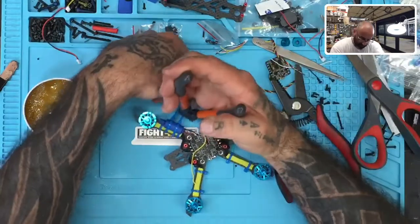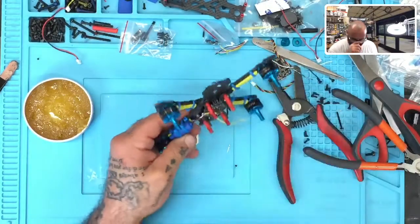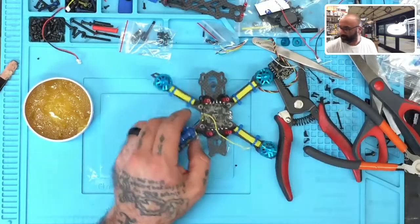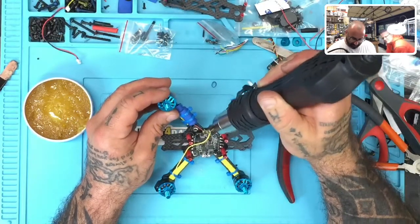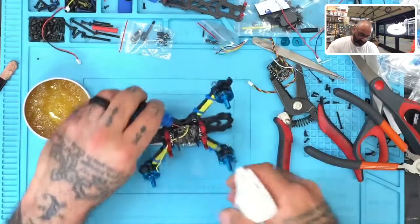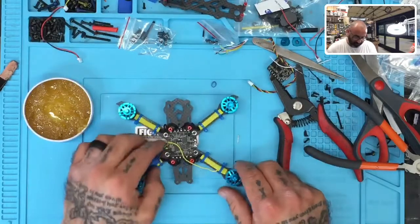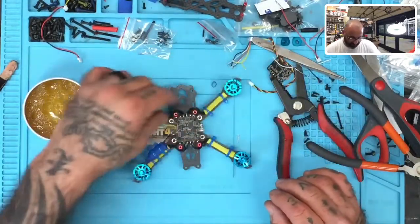The capacitor is solid — it's not moving. Now we can trim the zip tie ends. The cap is on there pretty solid, but I'll also add some hot glue when the build is finished to cover those pads. Actually, let me just do that now — drop some hot glue right there. A little trick with hot glue: once applied, take your heat iron and just hit the area. It pushes the hot glue into gaps to fill them. Add some air to dry it quickly, and it'll harden tough but come off as one piece when removed. Now our ESC work is done.